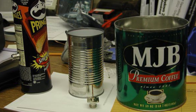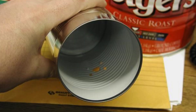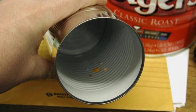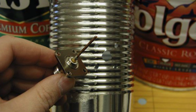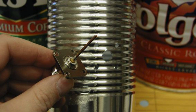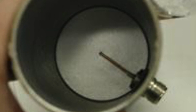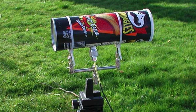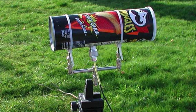Fourth, connect your cantena to your wireless card or access point. To use your cantena, you will need a special cable commonly known as a pigtail. The pigtail connects your wireless card or access point to your antenna. One end of the cable will have an N-male connector and the other end will have a connector appropriate to your card or access point. You will want a wireless NIC or access point with an external antenna connector, or you may have to hack into the one you have. It is suggested to use the Orinoco cards which have a nice antenna connector. Pigtails can be handmade if you have the right tools, but it's easier to get a pre-made one. This antenna has a linear polarization, which means that rotating the antenna will affect signal strength. You can experiment with rotating the tin can while watching the signal strength on your PC to get the best performance.